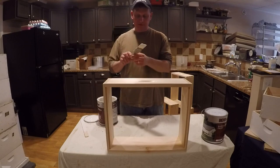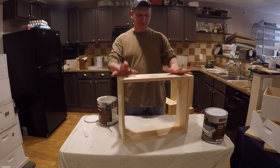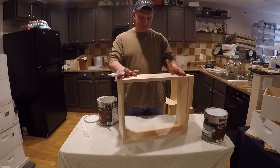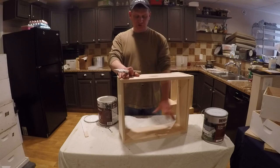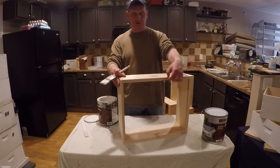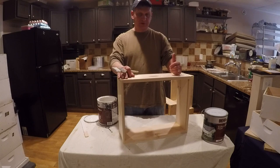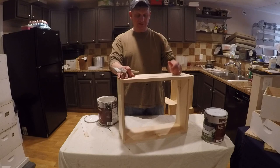For painting, I use an inch and a half brush. Keep in mind, I've already built these boxes a couple days ago — the glue's already dried on them, so we shouldn't have issues with the glue interfering with the paint. What to keep in mind is you never want to paint the inside of your hive box. You always want to leave it as natural wood as possible. I'm just going to paint the outside of the box here. If you get a little bit of paint on the edge, it could be an issue, so just let the boxes dry. If you want to scrape the heavy paint, just scrape it off with a utility knife or a paint scraper — we're trying to prevent any paint getting inside. There's no need to paint the inside of the boxes.